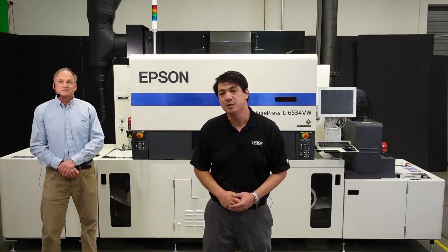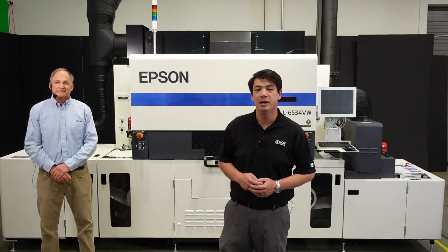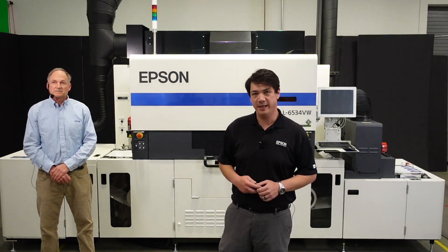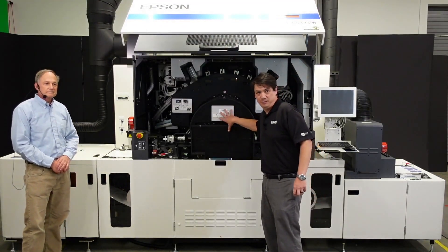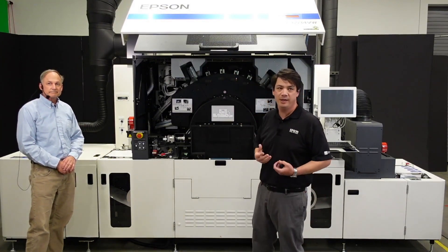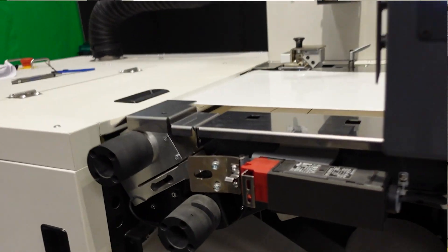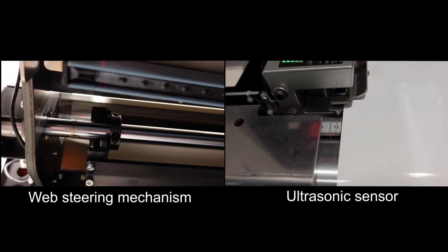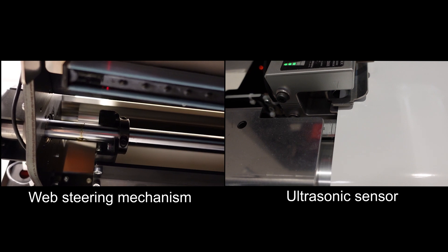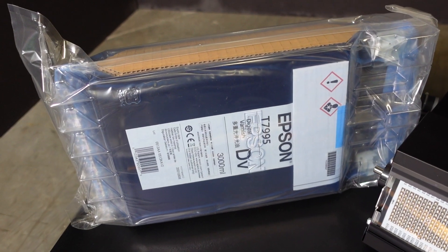Let's talk about how we reach those impressive print volume numbers while maintaining beautiful print quality. One requirement is to provide a highly automated, high-quality print process with minimal mechanical adjustments. Using a center drum ensures consistent, predictable distance between the printhead and the print surface. Web steering and automated web tension monitoring ensures a predictable web feed. Automated nozzle verification ensures quality without manual visual inspections. Electronic adjustments made at the touch of a button minimize mechanical mistakes such as over-tightening an adjustment knob or stripping a screw.